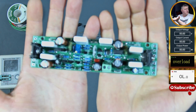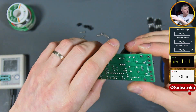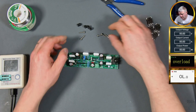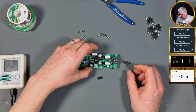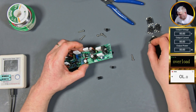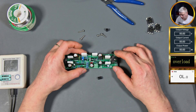Here we go - this is how the board looks without the power transistors. Looks everything nice, all the solder joints look really cool. What I'm doing now is soldering the power transistors. I have these standoffs because I'm going to put them underneath - like that the power transistors will be at the right distance from the heatsink to the board. Like that I can put everything on the heatsink, also the board with some standoffs.